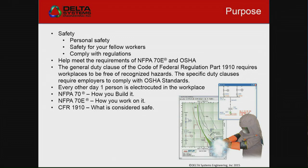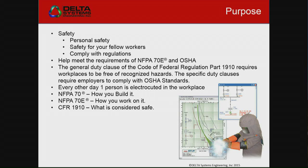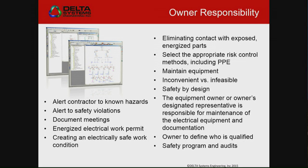A lot of stuff has changed with the new iterations of NFPA 70E. This is primarily here for the U.S. We've got NFPA 70 — basically it tells you, as an electrician, how you've got to build it. And NFPA 70E is how you're supposed to work on it. Then we have OSHA codes that consider what things are safe. The owner has a whole new set of responsibilities — they've got to alert the contractor to the known hazards. You've got to give them arc flash assessments, tell the workers what kind of stuff they need to be aware of, and document things. They have to create energized work permits — that's new.